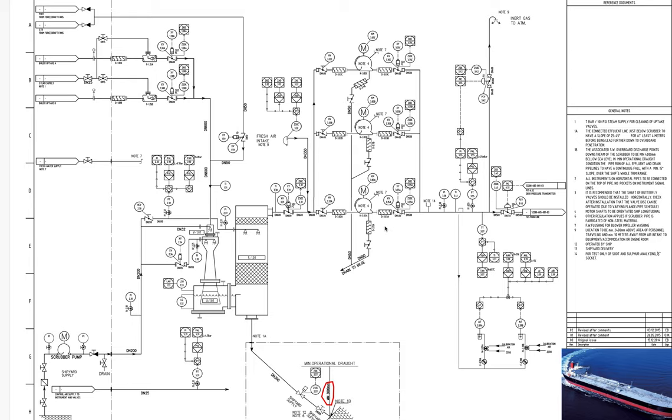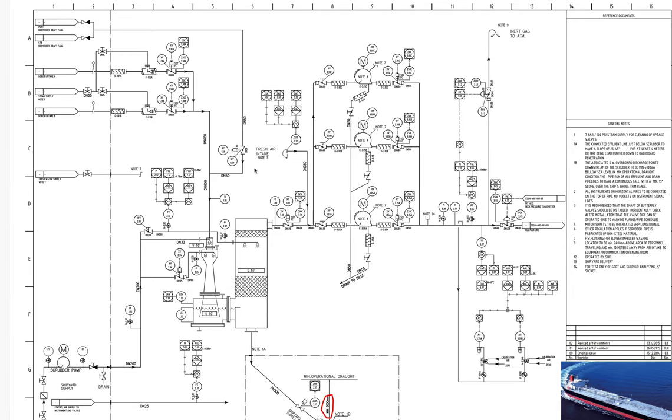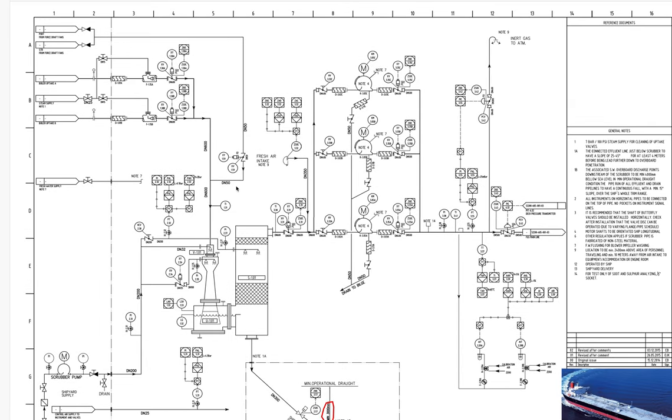As shared in previous videos, it is really really important to verify that you will not have any leakages from these valves, and that you will not get any air sucked in from the drain line. If this valve is not closed, some air will be dragged in and you will have a higher oxygen content identified. From this point, if this valve is not closing well, it is possible to suction air — so these are the points where you can check where you are losing your line integrity.